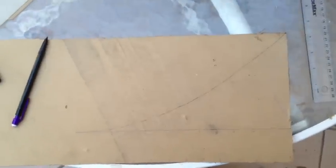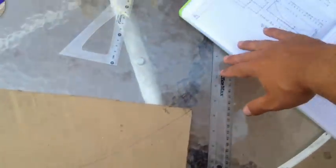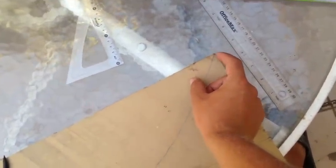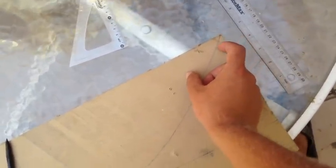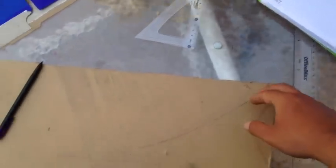There's my curve. You can see here, it gets pretty steep right here as it gets to the same height as the focal. Now if we keep going, it would just get really steep, and we'd have so much reflective surface, but really, because the sun area that we get is direct head on, here you have more reflective material and you're getting less sun. And as you get in, you get more and more sun on a certain amount of material. So it's really not good to go past this height.